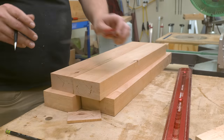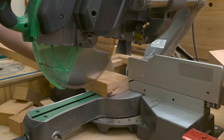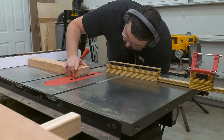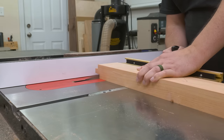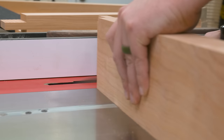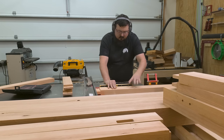Skipping over the milling process for the rails, I'm laying out my final cut line and cutting them to their final length. At this point these dimensions need to be spot on — if not, the base may not be square and the top won't fit on properly. Once those are chopped down, I laid out my tenons exactly as I did for the top of the legs. The tenons vary in size and placement, so I need to be careful. When cutting tenons like this, I like to test the fit by taking a nibble off the end of the board first. I also batch work these out: do all my half inch tenons, then move the blade height and do the next set.